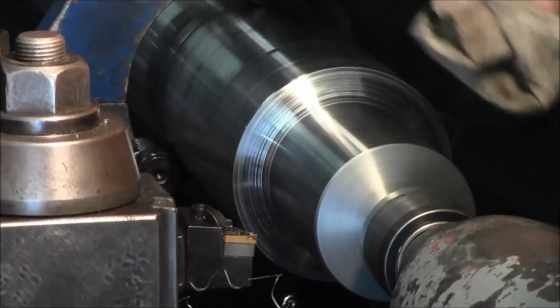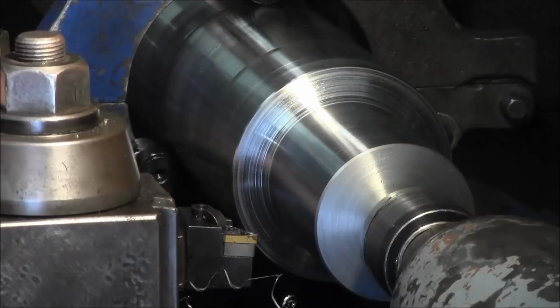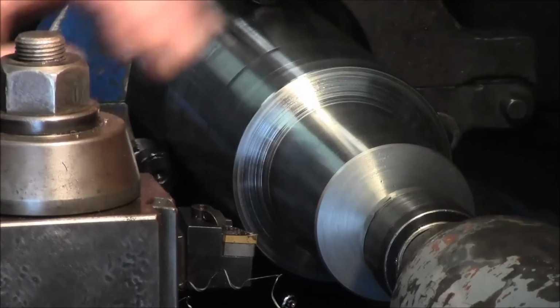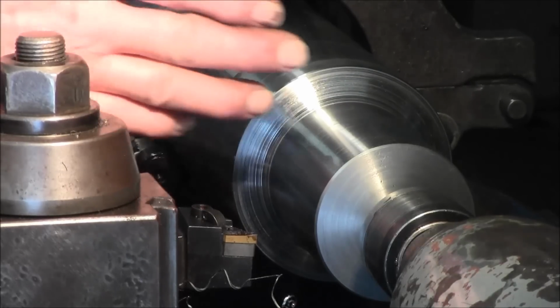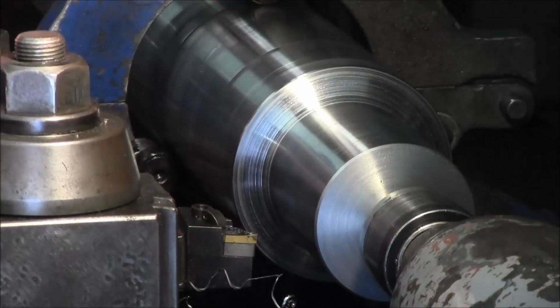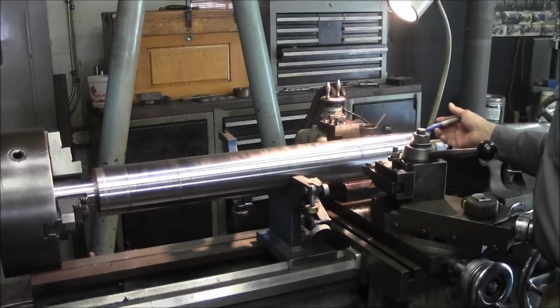Alright, now there's nothing sharp that cut us or anything else there, and now we're going to go ahead and lift this up, rotate this around. We're going to chuck on this diameter, and then we're going to turn an area in for the steady rest ride so that we have the length for our next reduced diameter for the other side of the drive and bearing side. Turn diameter into chuck here, and we're in the steady rest over here.